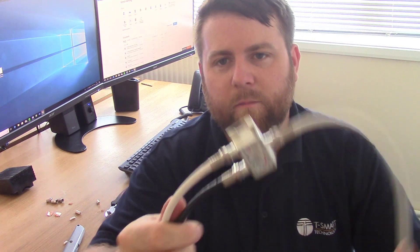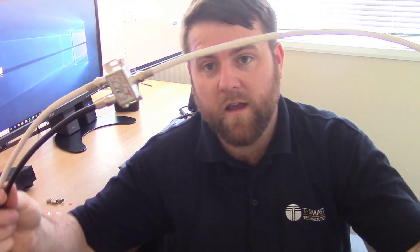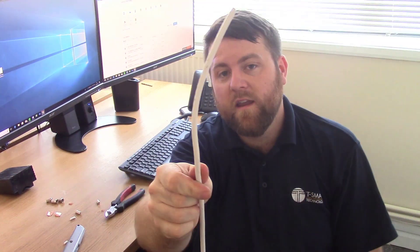That's what it looks like — it looks a bit like a two-way splitter, but it's not. The way we've got it set up, it's actually combining two signals onto the one cable. You're going to have to imagine that this cable carries on running all the way to your TV where you need it. We've got the problem where there's only one cable, so at the other end you're going to have a Sky box or satellite box and a TV aerial connection — that's the whole intention of combining them, so we're going to have to separate them.